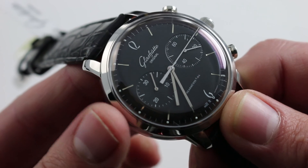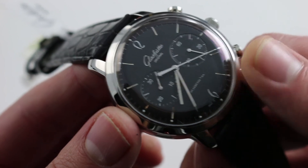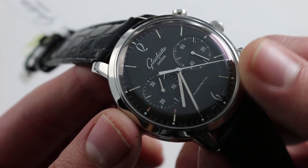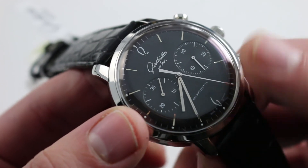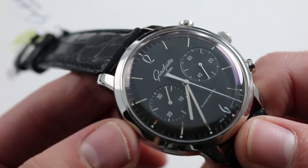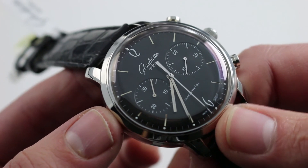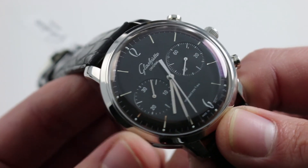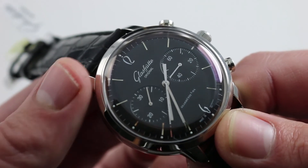The case gives way to a dial that is exactly the same in spirit. It has a nice 60s-style bi-compax chronograph arrangement, whereby you have chronograph seconds at center, a chronograph minutes counter at nine o'clock, and constant seconds at three o'clock. It is a modular chronograph, so you get the advantage of vertical clutch engagement — meaning you can simply leave the chronograph engaged if you prefer to have hours, minutes, and seconds constantly at the center of the dial.